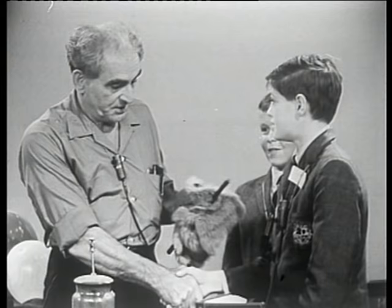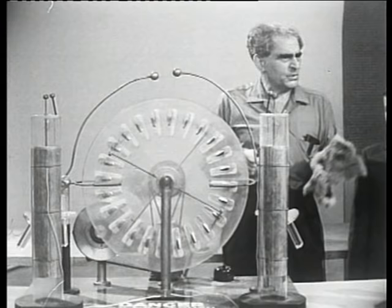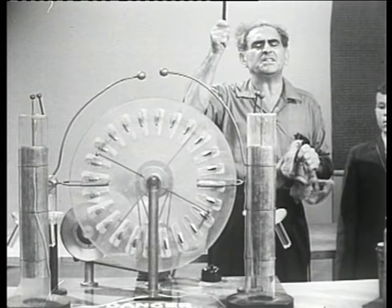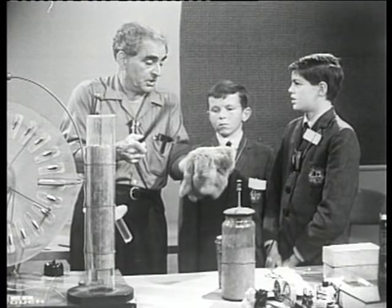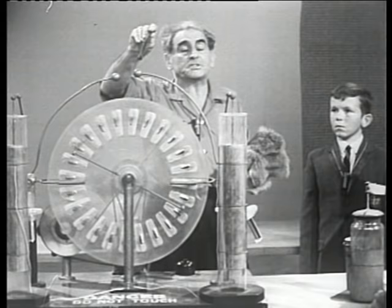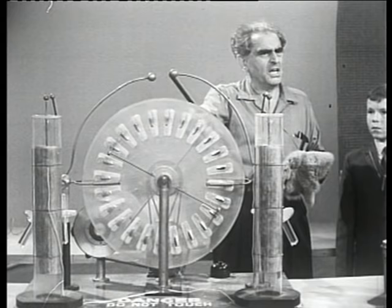Wynton, my pleasure to have you. Here is a machine which can be turned by hand and equivalently does the work that I'm doing here. The charges are stored in two devices here and here called Leyden jars, L-E-Y-D-E-N. The machine separates charges, with the result that one of these knobs becomes positively charged and the other negatively charged. A great difference of potential arises — much more than I can get by hand — and a tremendous spark can be made to pass from knob to knob.